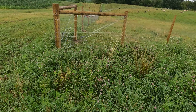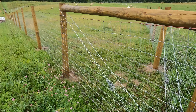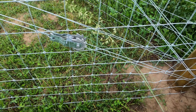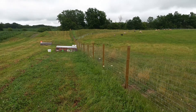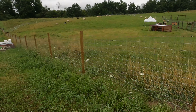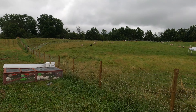All right — finished product. All three corners are cemented in. We did H-braces with simple strainers holding them on. We did a four-foot no-climb sheep and goat fence all the way down. Ended up doing 1,200 feet just like this. There's the herd now — they've got a bigger spot to graze out there.